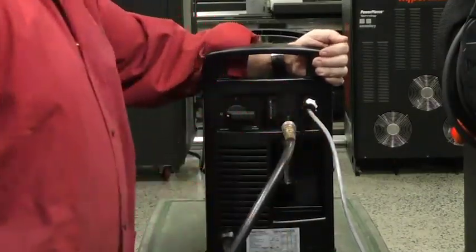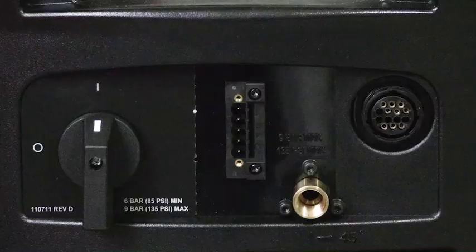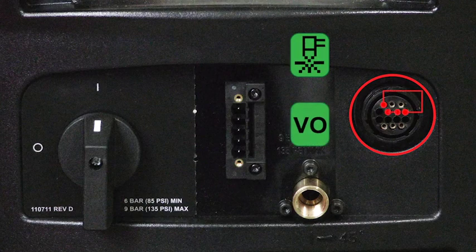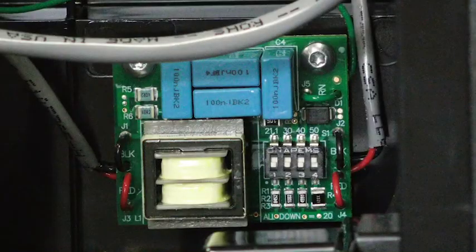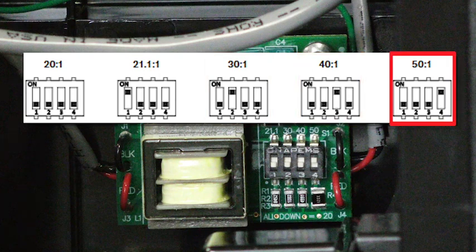Connect your gas supply to the Powermax Sync system. Most cutting tables use a CNC controller or software to operate the system. There are two options for controlling the system externally. The CPC receptacle is discrete communication — when installed, it allows the operator to control the plasma start and stop signal, divided arc voltage for torch height control, and transfer signals for table motion. The factory-installed voltage divider PC board supplies a divided arc voltage in proportion to the cutting arc voltage, defaulted from the factory to a 50-to-1 voltage ratio. However, depending on the cutting machine being used, it may require different settings, and the Powermax Sync system has additional selectable divided arc voltage settings for easy installation on different cutting machines.